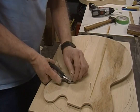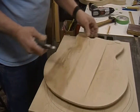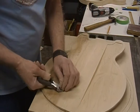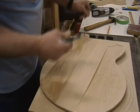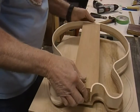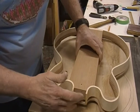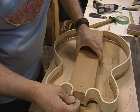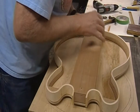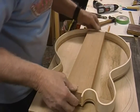And I'm cutting them off pretty much flush with the maple as much as I can with the cutter, while being able to get my hand under it. Alright, so now I can line this thing up. Obviously the center beam is 4 inches, the same as this. So I'm eyeballing all of that together. The front is pretty much right with the block, probably a 1/16 proud of where the block is at, because the block should be exactly the right length.